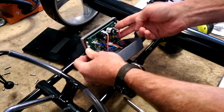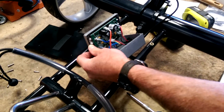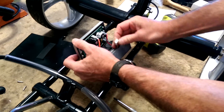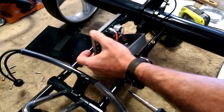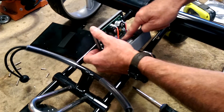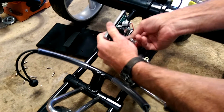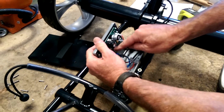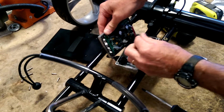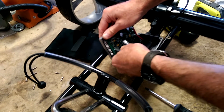There are seven connections: two motor drivers for the left side and two for the right side — you can follow the wires and see where they go. You've got a control cable, which is this white data plug — I'll just disconnect that; it's keyed, it only goes in one way. Your power lines come in from your tray with a positive and a negative. On this model the red wire goes in between the caps, and the blue wire goes over by the connector. On these you've got a blue wire on the right motor that plugs in on the same side as the two big caps, and a black wire that plugs in on the bottom.